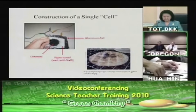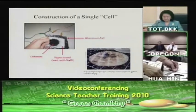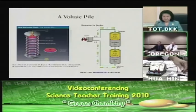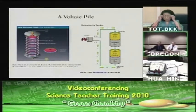So with that let me just repeat what we talked about for the other one. Here we're getting almost a volt with the aluminum; with the copper we only had half a volt. A volt is still not enough for the LED, but if we make a stack of two of these, we should get enough voltage to light our LED. So we will try that.